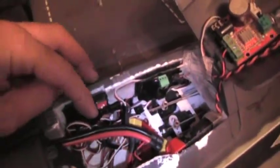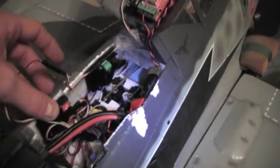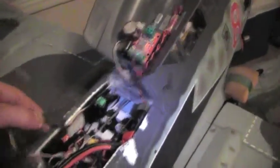Now in the FW-190 right here — this is the hatch area. The reason I did this was to spread the components out. If you look in the bottom behind that servo, you'll see the speaker — it's actually mounted in the fuselage with a hole cut between the spars and the wings, which I saw somebody else did on the groups and it's a brilliant idea. Here's the Pro B sound card, here's the Pro B gun card which is used on any Pro version. If you put a servo lead on it and do that Y split connector with two females off your sound card, you can plug it into the A I was just showing you and now have gun sounds on that A card.